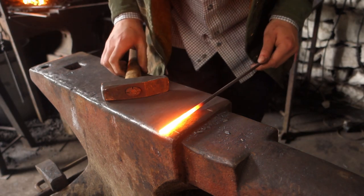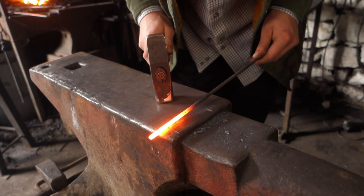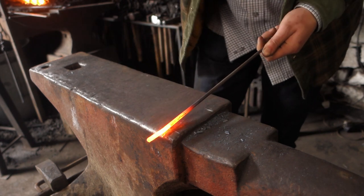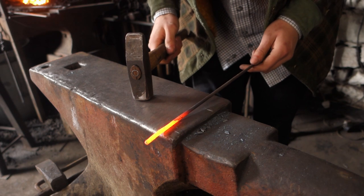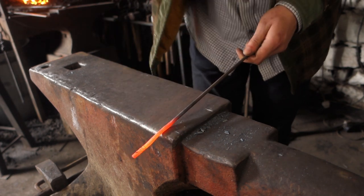I've got this mark on the anvil and I'll eyeball it, then section that material over the far edge of the anvil. I'll forge over four sides so we get a nice isolation point there, and then draw down a taper.